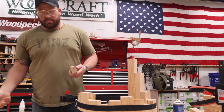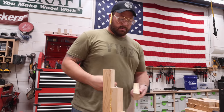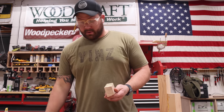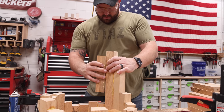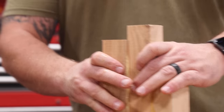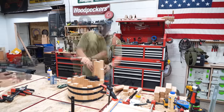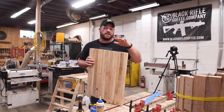What we're going to do now is start gluing pieces around and make a spiral that comes the whole way around. I'm going to use a little CA glue to clamp — from the last table like this I learned that stuff wanted to explode apart, so you put a little CA glue on the end and on your cord. I'm going to incrementally bring these in so the spiral comes to the center; it should hold together enough to get straps and tape around it.